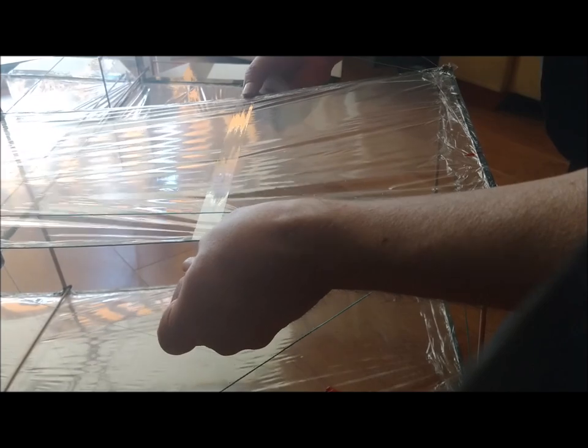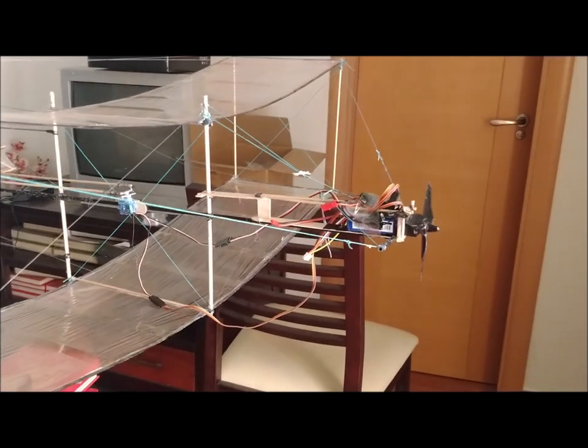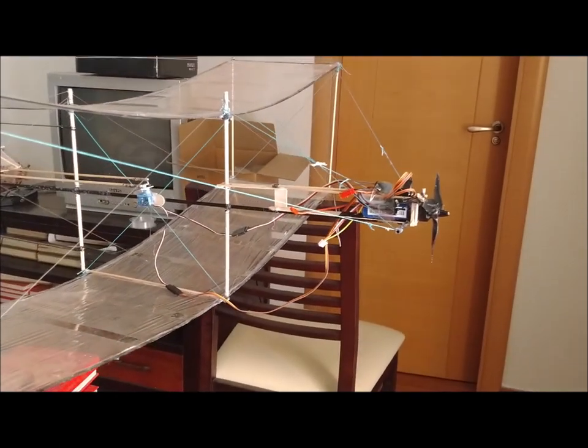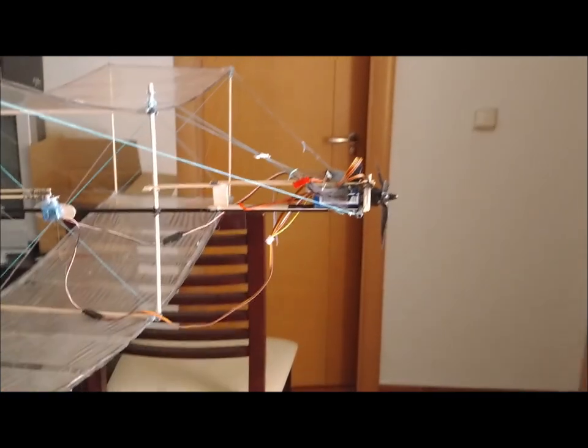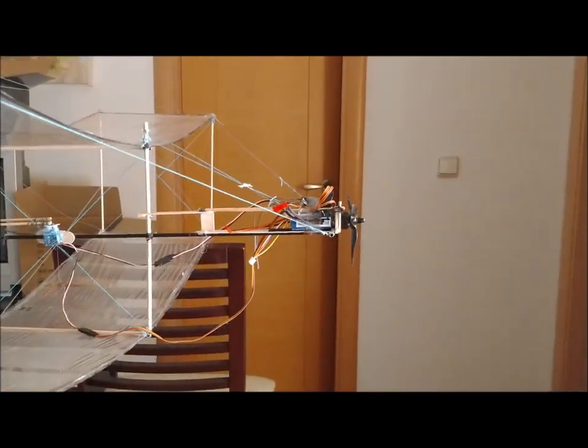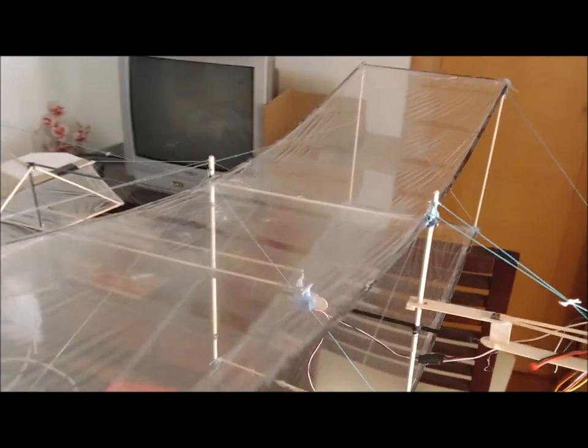In the latest version, transverse strips of scotch tape have been placed to fasten the cling film on the wings. We did not want to use duct tape strips, as they weigh too much. We have removed the angle of the motor, so it is now completely horizontal. The rudder area has been increased, so we have almost doubled the area for the rudder. The width is now 21.5 centimeters.